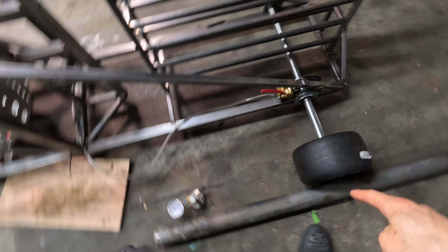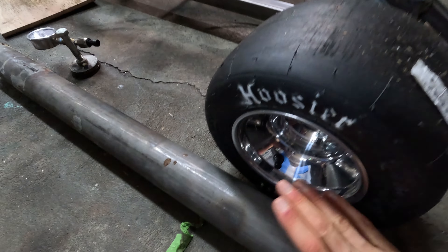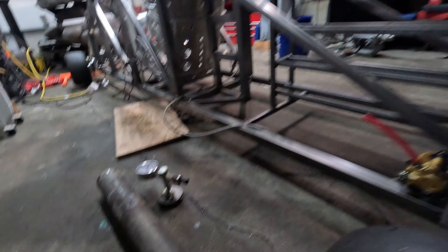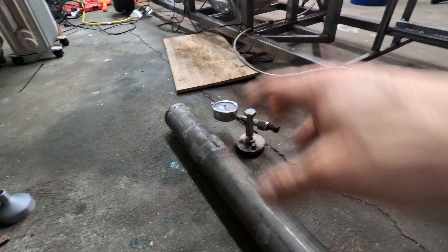Let's move to the back and go over what's powering these bad boys. We've got a five-foot rocket motor, and there'll be five of them here in these banks — this bank of five. This is three-inch diameter DOM tubing. We had a nozzle milled from 1018 steel on the lathe, and up front we've got an aluminum bulkhead with a pressure transducer and a gauge, just so we know what's going on and don't turn this thing into a pipe bomb.